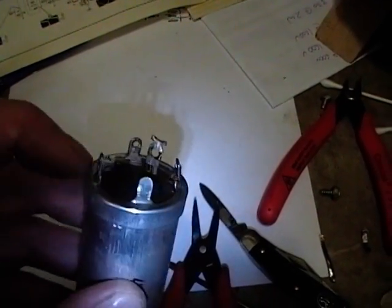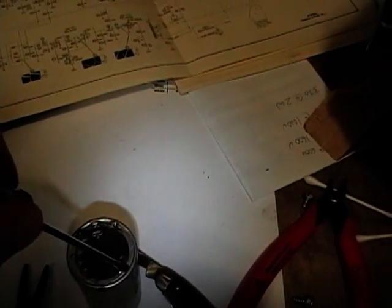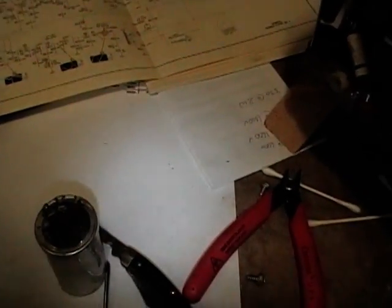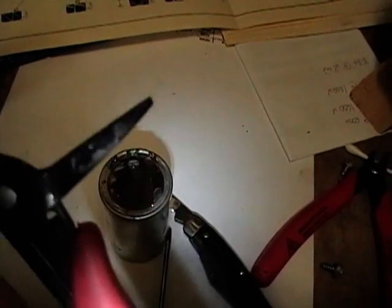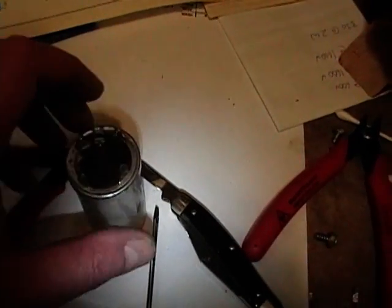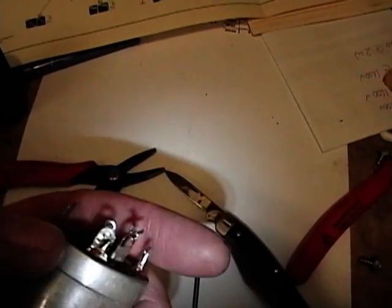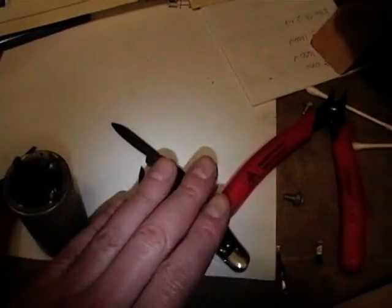I've been asked several times how you get these seams opened up. I don't have any magic trick — it's not that easy on some cans. What I start with is a pocket knife, just trying to get the tip of the blade under the edge, then I'll switch to a small flat-bladed screwdriver. Once you get it started it's generally not so bad — you can walk the screwdriver around, twist it, move it over and so on. Sometimes neither tool will get it going and I resort to small needle nose pliers with a serrated edge, squeeze and pry it over. That will always work but it'll damage the outer edge, and will definitely gouge up the side.